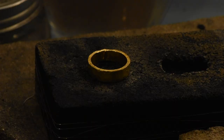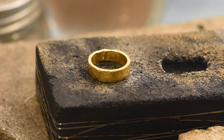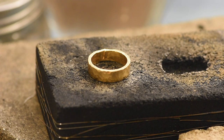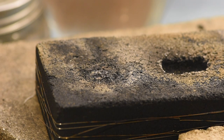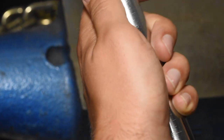I might hit it for just a touch with some fire to get it up to 11. Basically using the rubber mallet now because the texture's in — just wail on it with the rubber mallet. We're sitting at 10. This is definitely make it or break it. I do not want to go too high. I'm going to point the light away so I can watch the color better — the direct light makes it look just yellow, yellow, yellow, and you miss the pinks, reds, and oranges. Do not want to miss the oranges.